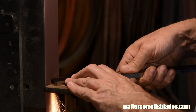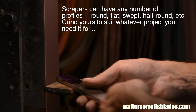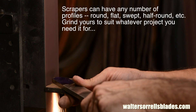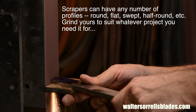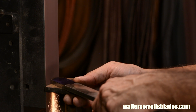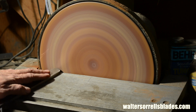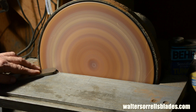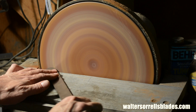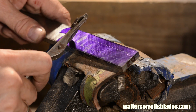Now I'll grind it to that shape on my grinder. Prior to heat treatment, I'm grinding the face of it square, but you can set your table to whatever angle you want to use for your final angle — that could be 60, 65 degrees, whatever. Later on I'll use my disc grinder to cut in that final angle. I'll also grind the tang, making it about two and a half inches long.